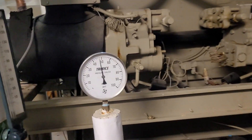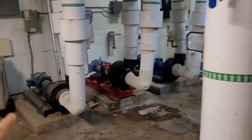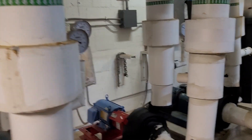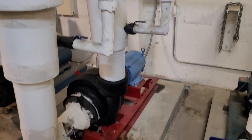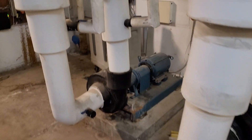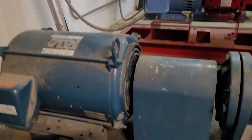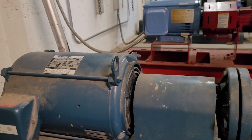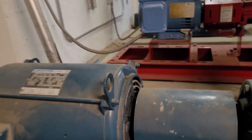I double-check at the chillers — same result. When you run pump three, no difference at the gauges at the chiller. When you run pump two, you get a psid differential. Also, when I turn off pump three it spins down really easily — just keeps spinning and spinning — and typically they don't take that long to spin down. So I think there's no resistance on this motor.